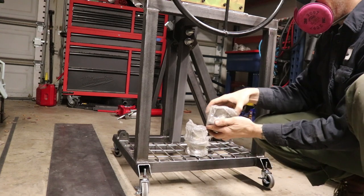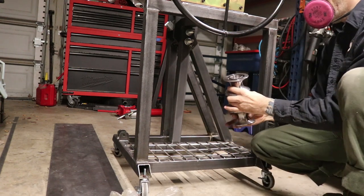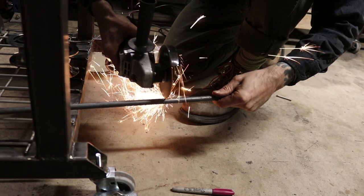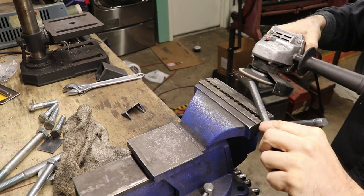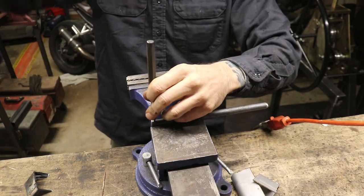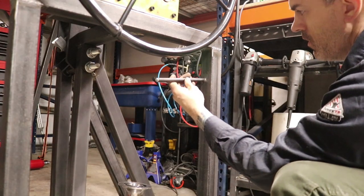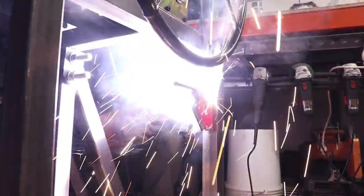We've got several dies for the roller and the tubing bender, and I'm going to incorporate little hangers onto the cart itself to hang these dies. To do that, I've got some half-inch round stock, and on the end of the round stock — before I weld it onto the cart — I'm going to drill a little hole to put a hitch pin or cotter pin through to hold the dies on, so if I'm rolling this cart along at high speed the dies won't fall off. I'm using a standard welding magnet to hold the half-inch rod at a 90-degree angle on the cart as I weld it on.